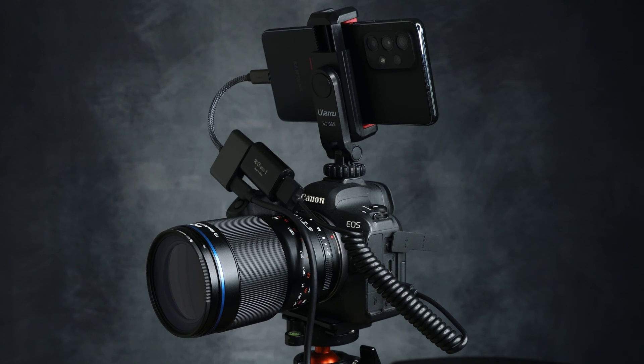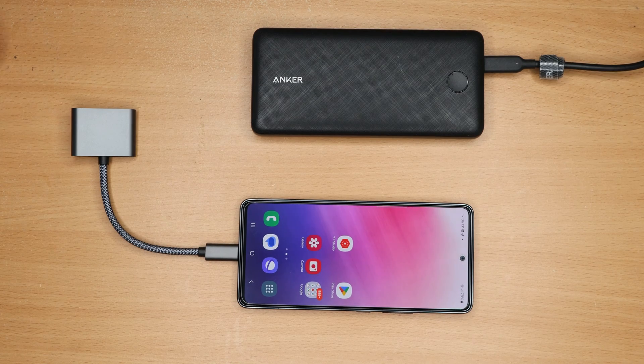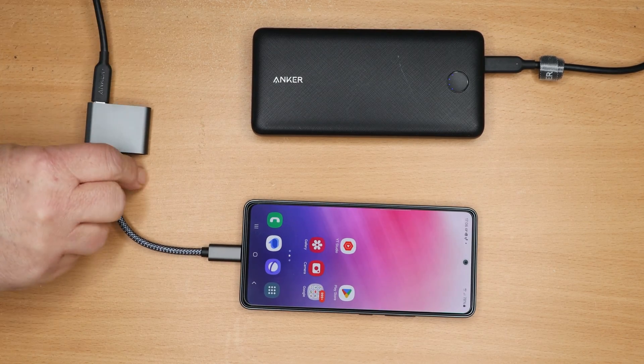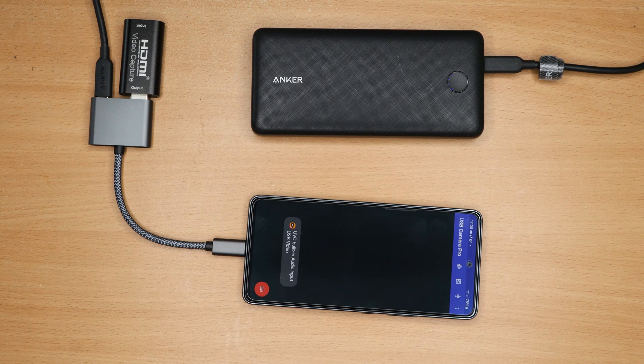In my setup of using my phone as a field monitor, I use my Samsung A53 5G phone, and Samsung lets you charge and run peripherals simultaneously. The setup I now use is almost the same as in my other video, but I swap out the original OTG cable for a USB-C OTG charging splitter adapter. The male USB connector plugs into my phone, and at the splitter end I plug the power source into the female USB-C connector and the video capture card goes into the USB-A 3.0 socket. I'll put Amazon USA and UK links in the description to this USB-C OTG charging splitter adapter.